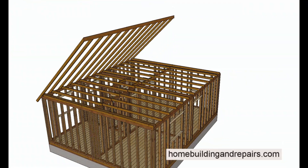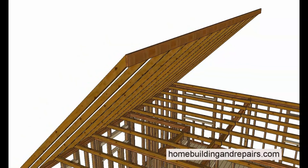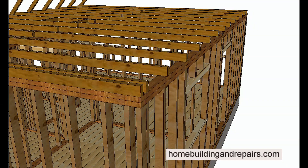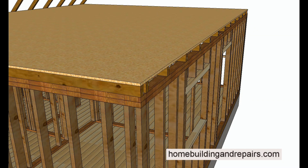In most cases the first thing you will need to do would be to remove the other side of the roof. This would require you to shore up the roof on one side. Next, you need to make sure that you have some type of subflooring. If you have an attic with a subfloor already, there's a good chance it wasn't designed to be used as a floor. You might need to install larger joists, and this might require additional structural members. If you do have a floor, it might stop about eight inches away from the edge because you have a roof rafter coming up — in that case you might need to block it, fill it, or cut a section back.